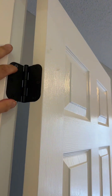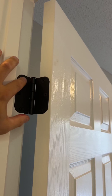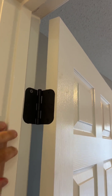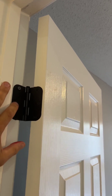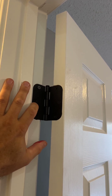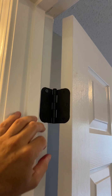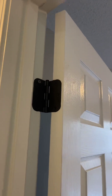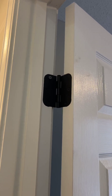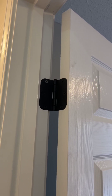Basically, you'll get a lot of houses that have 3 inch screws, and they're stripped out — they're not going tight, so the door ends up moving around. The old way is to put toothpicks in here, or golf tees or something like that with glue. That stuff is not something that's going to last for a long time. It could work, it could not work. These tricks all come from doing a lot of houses, and I know it works. We've all tried it — it all works great.